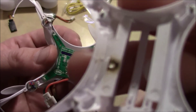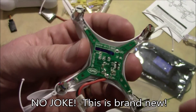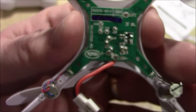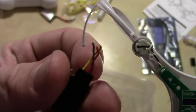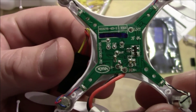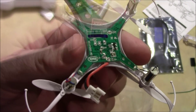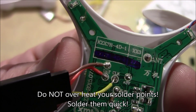Look at that — it's already pre-burnt. I got a pre-burnt version. Anyway, I haven't even flown this yet, and that is an honest truth. Right here is the ground, this is the DAT, and this is the CLK. Those are the three points that we're going to be soldering to. Since all the pieces in here are individual, it doesn't matter what order we solder these in. My ground is the brown wire, and then the other two I just got to remember where they go and solder those on. Then we'll flash it, and once it's flashed with the new firmware, we'll just unsolder this because I don't ever plan on changing the firmware again after the acro is on it. The three wires are soldered on — I got the brown wire on the ground, and the other two in that order: ground, CLK.